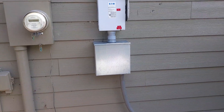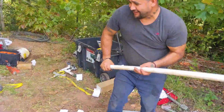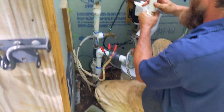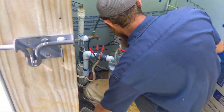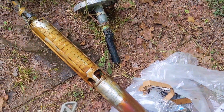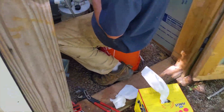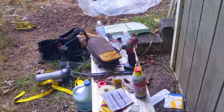The well pump is up and running. We're putting in the hand pump now. We just finished putting in a Grundfos SQ Flex pump with soft start to complement the solar system we just installed. We took out a beast of a Grundfos — it was working fine but had been in for 14 years. We replaced that with a soft start and were able to put it on the existing wire and pipe that was in there, which saved us a bunch of time. We mounted the well wheel up in the corner, which saved our backs.